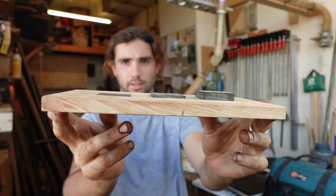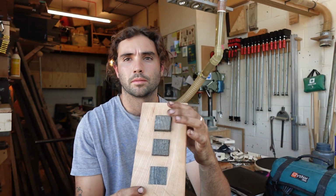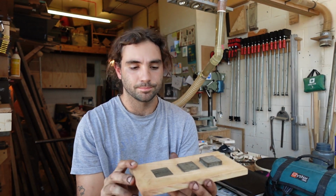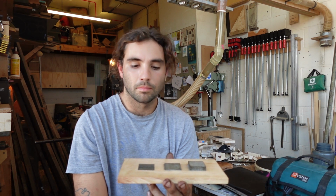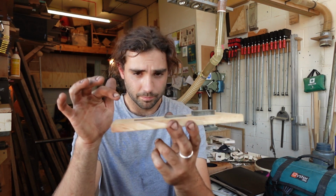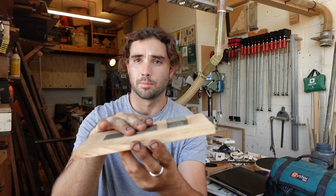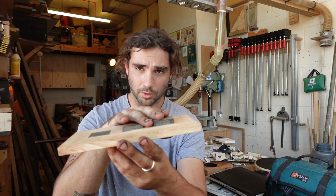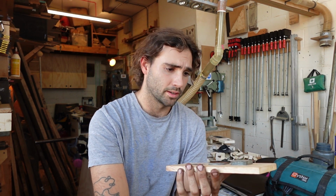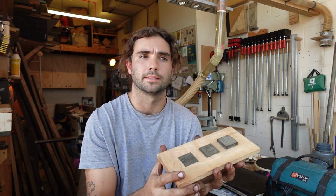But this was, I think, the first thing that I made as a sculptural exploration. You can see they're all different layers, and it's all ash, and those were 12mm, 6mm, and 3mm, and that had sat in the ebonising solution over the weekend. And then the inlay rebate is all 3mm, and so that's flush, that's 3mm above, and that is 9mm above, which is a thing.